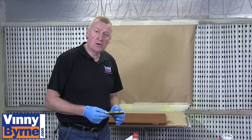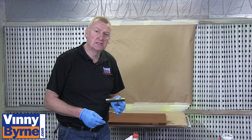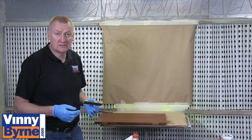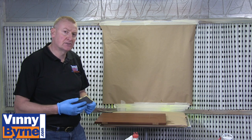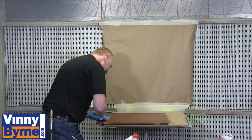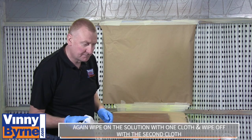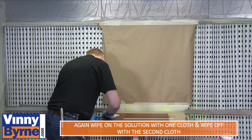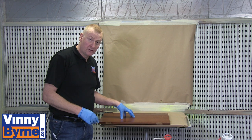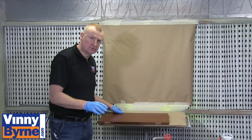The surface is quite good, so I'm going to key it in with P240 grit — not too rough. It's different from wood to wood; this is a hardwood. If you're using soft woods or even MDFs, you may need to use a slightly coarser grit. I'm now going to degrease it again. I've sanded it with P240, cleaned and degreased the surface again, removing any sand and dirt.